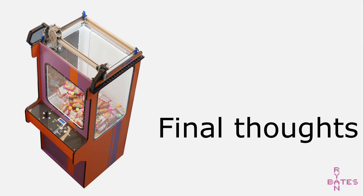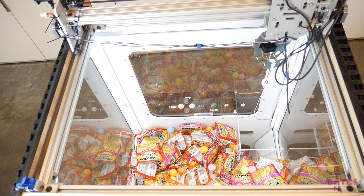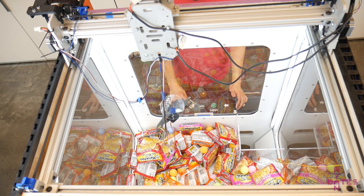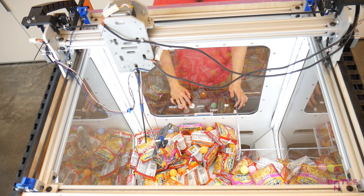This machine was a very fun and challenging project. All design files and code are open source. There is a SOLIDWORKS drawing packet that illustrates scale and hole patterns on critical motion components — use the part files and extract vectors for CNC work. Vector drawings for the gantry plates are also available, drawn in Inkscape for 2D fabrication. Overall the SOLIDWORKS files are good to go. This project is challenging if you have the tools and difficult if you don't, but still achievable with compromises. Happy building, and thanks for watching.